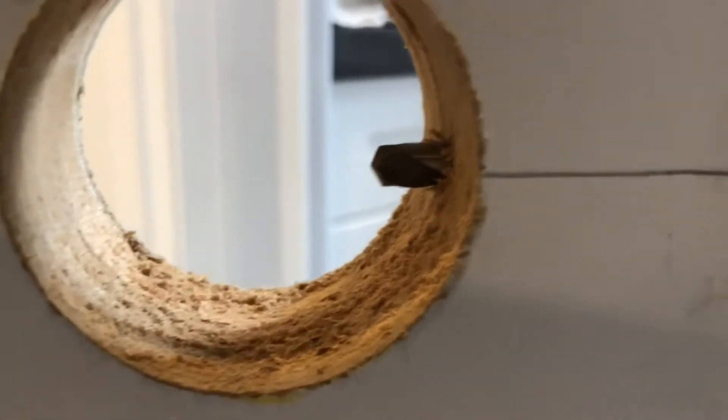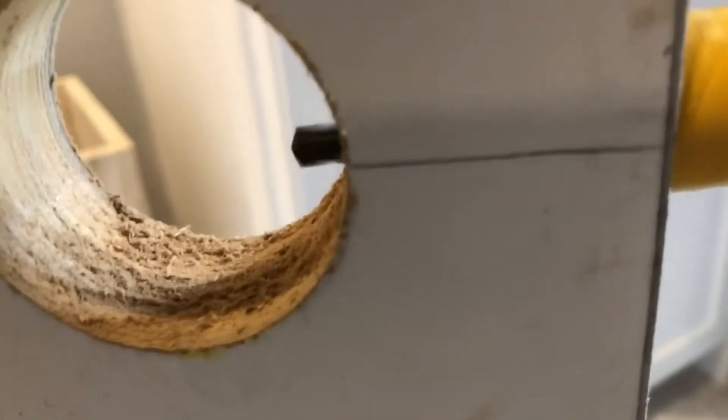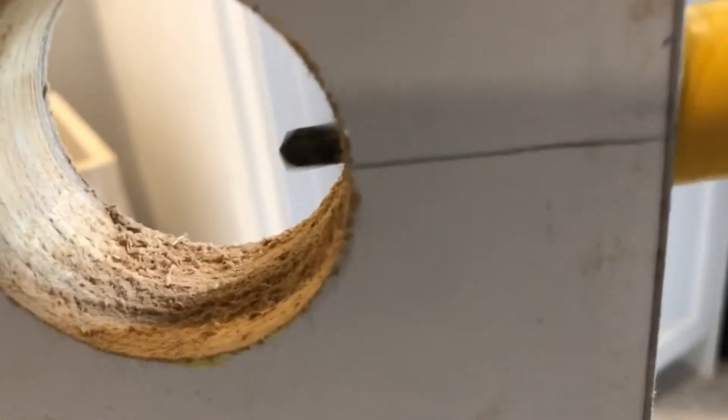I can either force the issue or go to the DeWalt, which is what I ended up doing. Switching to the DeWalt, you can see how quickly it handles that last 1/8" or 3/16" that is needed — it makes quick work of the door handle hole. This points out the difference between the two hole saws — a little misstep for Milwaukee, but all in all two really great products.